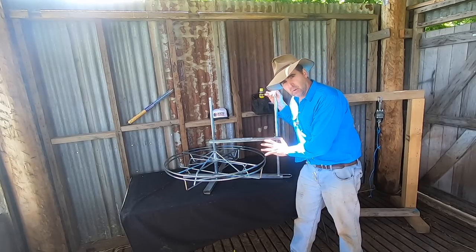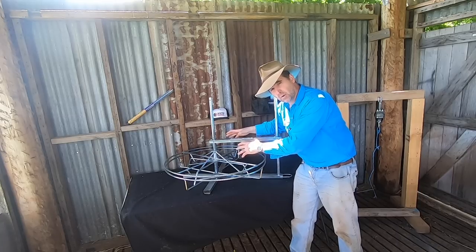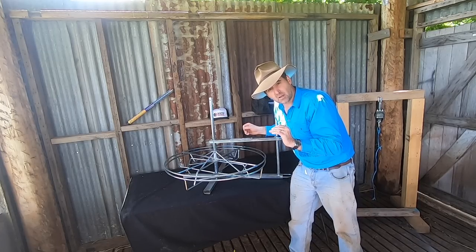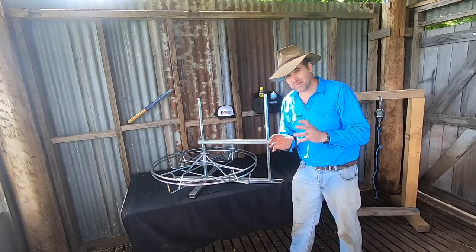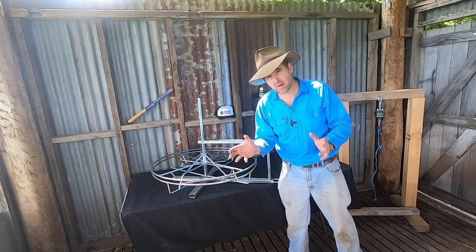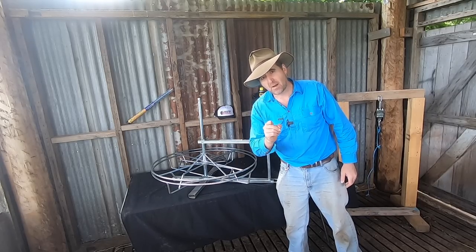Next up we've got the White's contractor model. This wire spinner has a few extra features — first off you've got a spring brake on the top, which is really a friction brake that compresses your coil onto the base plate and slows the spin down. Having that adjustable is really useful as you go down in the amount of wire left in your coil and it becomes lighter — that'll stop overspin and make this much easier to control. It's also quite ingenious for barbed wire: as soon as barbed wire touches the ground the barbs start digging in, picking up trash, making it just about impossible to pull off a fixed spinner. This spinner becomes a barbed wire trolley.